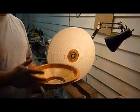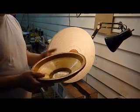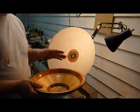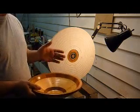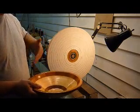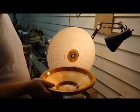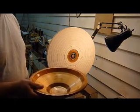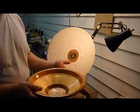So you have a little bit of a safety buffer in the event of a power failure — the piece is not just going to come flying out. That's a problem you could run into if you have just a vacuum pump. They do draw a lot of vacuum, but there is no tank. You could install a tank of some sort, but most people already have a shop vac, so this is a pretty good system. And of course, you can always upgrade later.